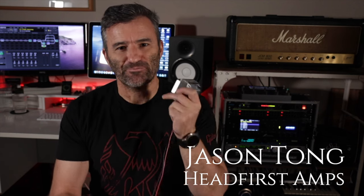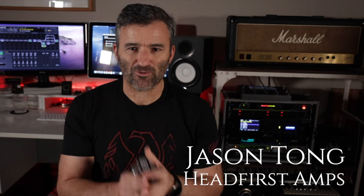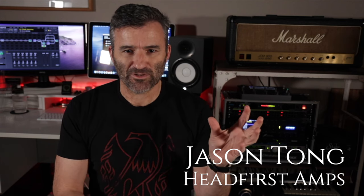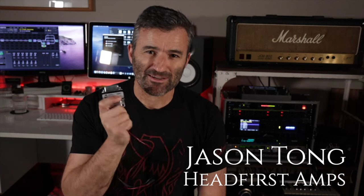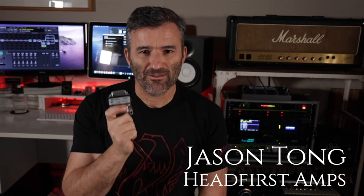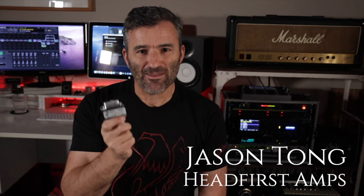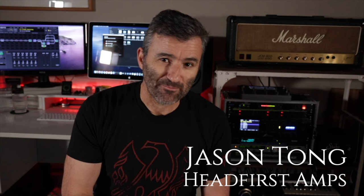The filter choke is a really important part of the power supply line, right? So if you look at the top of your amp, you'll often see a power transformer, an output transformer, and sometimes one of these little guys. I say sometimes because not every amp has a choke, but it's a really important part of the power supply and therefore the tone and the feel of your tube amp.